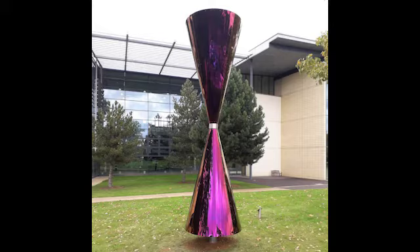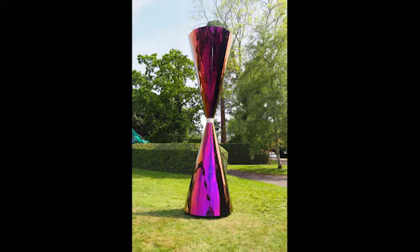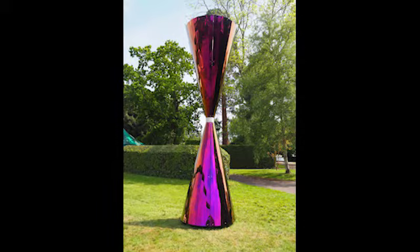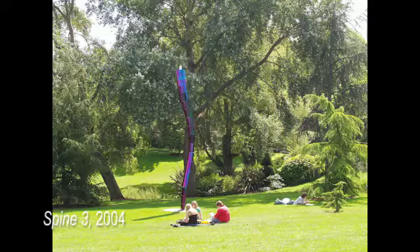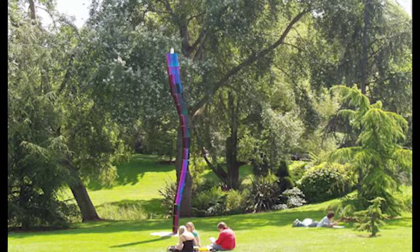The oxide can vary — when the coloured stainless steel is made it's dipped into a tank for a very short time, and the temperature and length of time it's in there creates a different colour when it's pulled out. The colours that work best are red and green. The red changes colour to a purpley blue, almost golden, and the green goes from purple to blue to almost a red colour sometimes depending on the light. The other colours with thinner oxide layers are possible too but not quite so versatile. That sculptural spine — in coloured stainless steel — amazes me every time I see it, because it changes colour just as you walk past.